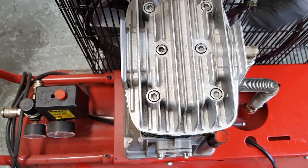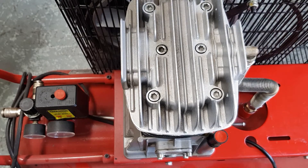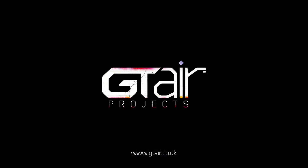If you want to maintain cooler head temperatures, you can leave the plastic cover off. Always run the air compressor at least 12 to 18 inches away from any walls. Don't install your compressor underneath a workbench or in a cupboard, as this can dangerously elevate the head temperatures causing premature failure.